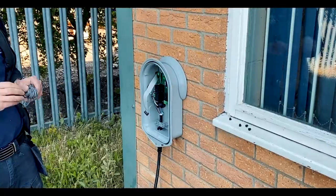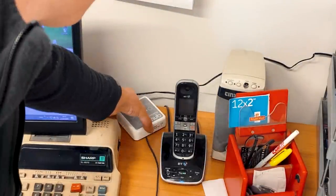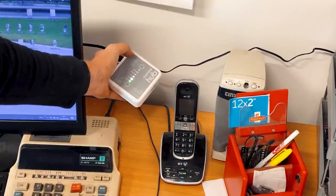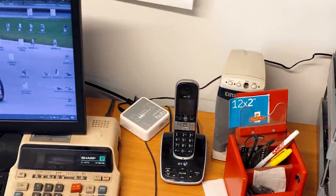We're just going to update the firmware on the hub now. Basically what you do is press and hold this little download button until the server LED goes white, then let go — that will start downloading the latest firmware. It can take a while, so it's worth doing that as soon as you get to site: just plug the hub straight into the router, power it up, do the download, and after about half an hour you'll have the firmware updates.